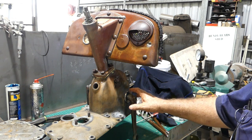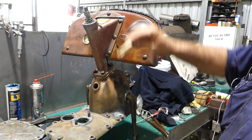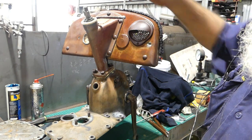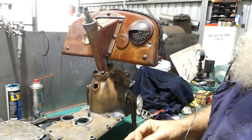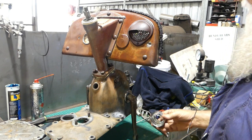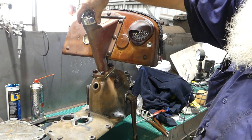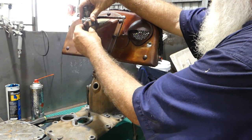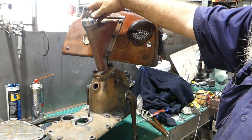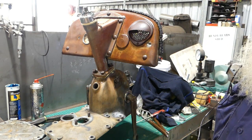For those of you who want to know how to do a steering box up, that about covers it. That is all we're going to do in this video for resealing the steering box. I had a look — this felt goes down that way and seals on there, then this spring comes down over the top, and this collar keeps the spring central and goes up through there. I'll probably use a new felt but use the old collar because we're trying to keep this tractor looking as it was — the old barn-find look. Hopefully that's enough with the steering box.